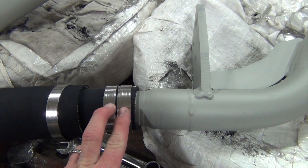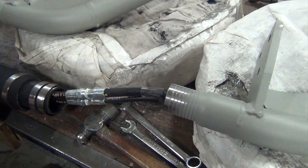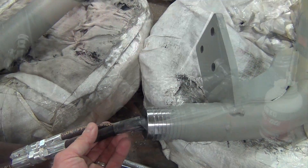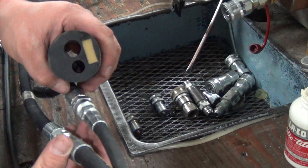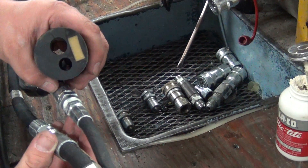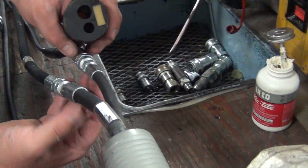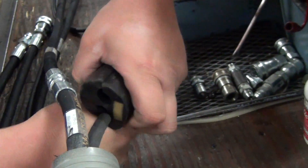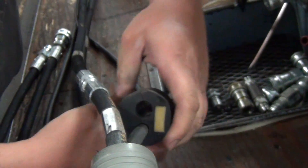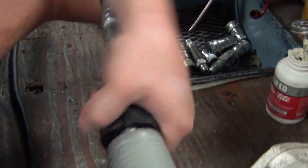After you've cut and exposed the two bands, we'll slide both hoses back and that will expose our motor hoses — this is where the sensor will be installed. As we install the sensor, you'll notice on the end of the plug there are two different size holes: one's a quarter inch for the pressure side and three-eighths for the return side. You want to put those on the matching hoses, starting at the corner to get the slot started, then snap it in. Do the same for the return side, then slide it all the way up to the end of the vibrator.